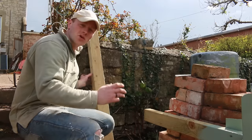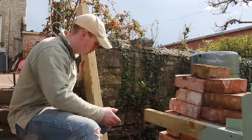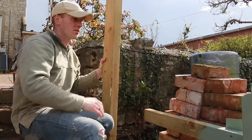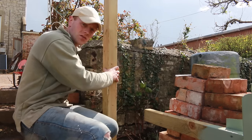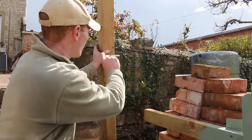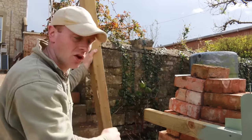This last post has got to be bolted to the wall. I still want to make sure it's kept off the floor at the bottom and I've treated the bottom of it as well. We'll cut a runoff to make sure there's no standing water on top. The plan is to use some big thunderbolts - they go through the timber and bolt it into this stone wall.